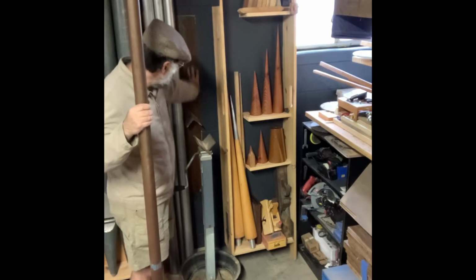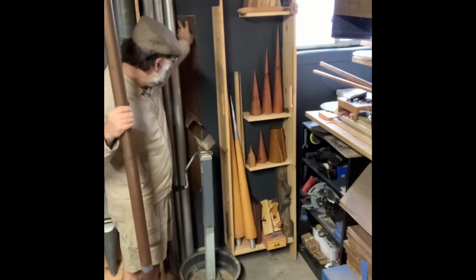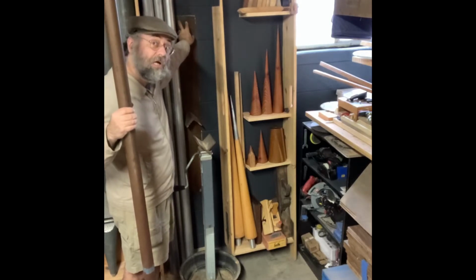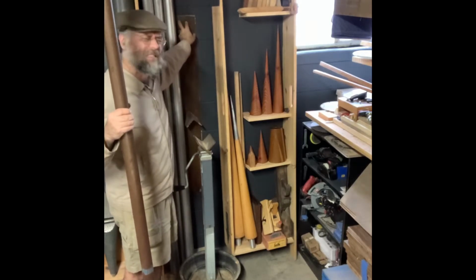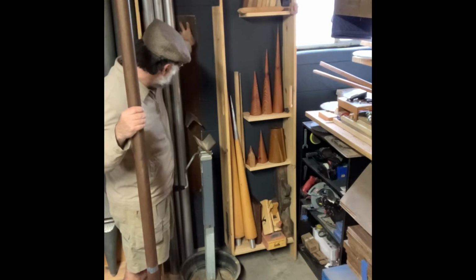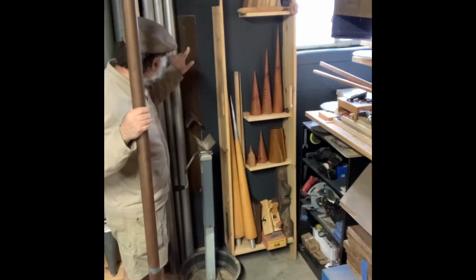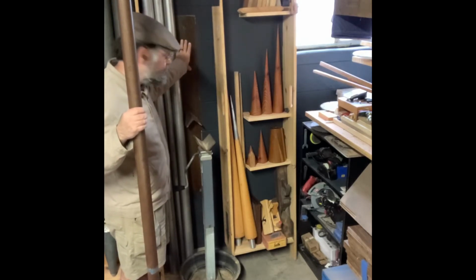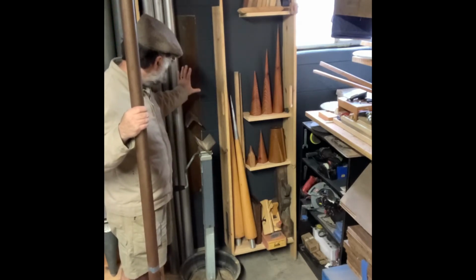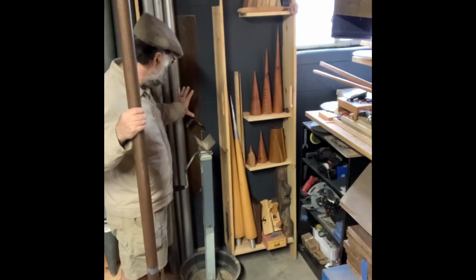This flat surface is not just screwed against the block wall, but I took one tube of your favorite construction adhesive that you can get at your local hardware store. Anyway, put one tube, big fat bead right in the middle on the back side, and after pre-drilling the holes into the block, I fitted it gently, one screw here, one screw down there, and then tightened it just like a cylinder head, nice and evenly in a certain pattern against the wall.